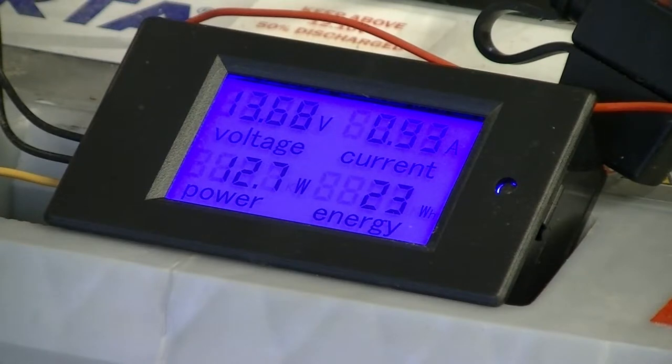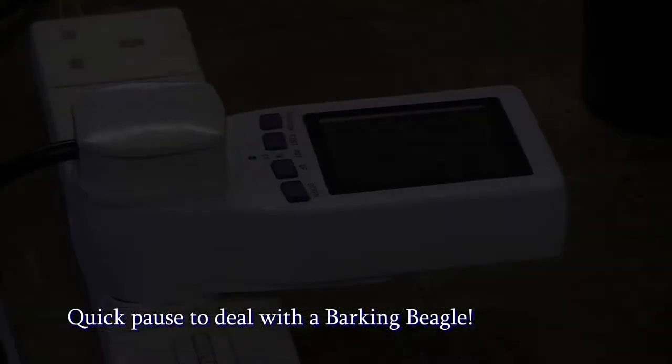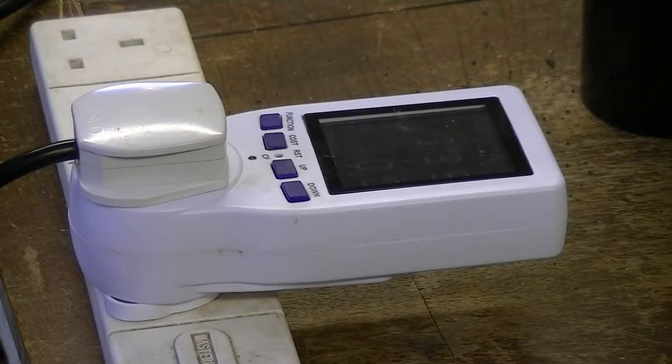When the fridge is on, I've got an AC wattmeter here that displays the wattage being drawn by the fridge alone. I can then get a fairly good comparison of how efficient the inverter is. Surprisingly, this Kotec seems very efficient — when the fridge is running it's typically drawing about 35 watts. These are very efficient fridges; I'm really impressed with the compressor. But when the compressor kicks in, there is an enormous load through the inverter on the batteries — for a few milliseconds I'm seeing 800 watts being drawn, and I think the transient is probably higher than that.